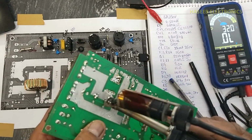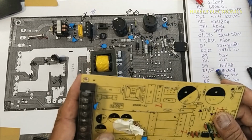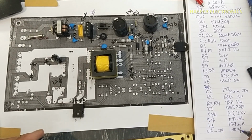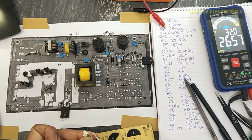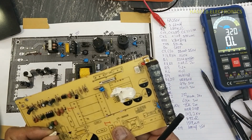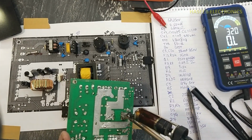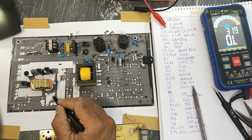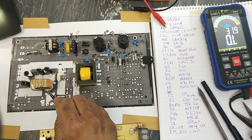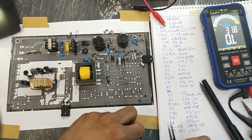Then we have output capacitors. C16, 17, 18, 19, 1000 microfarad, 35 volt, 2.6k resistor, 4 resistors in parallel, R29, 30, 31, 32. And here we have these jumpers. These two jumpers are connected from this point to the inductor. This preset here is for voltage adjustment,